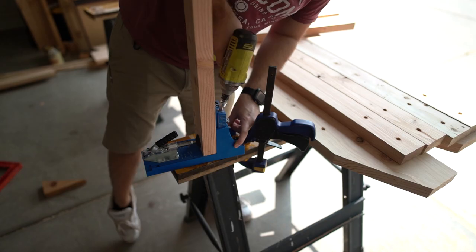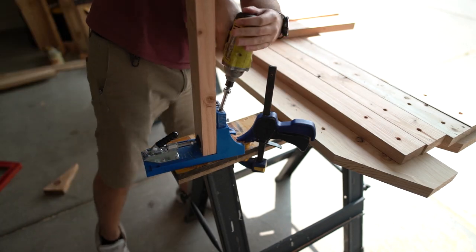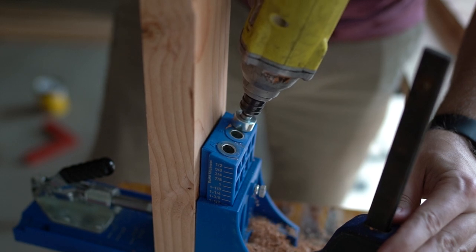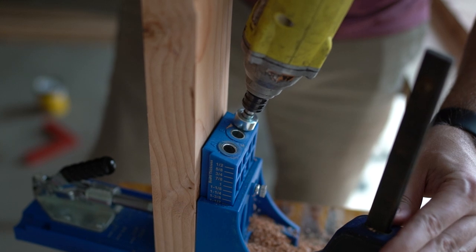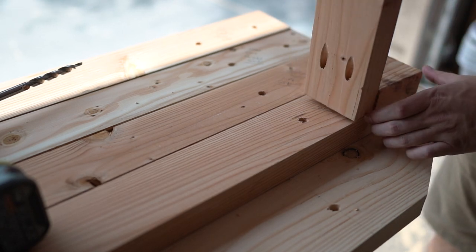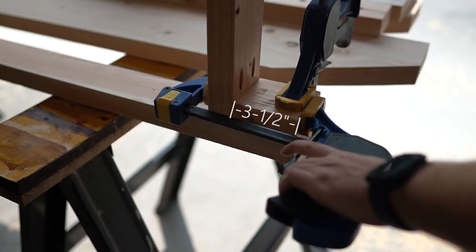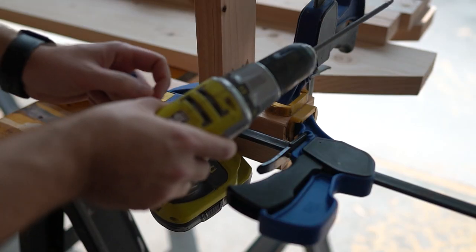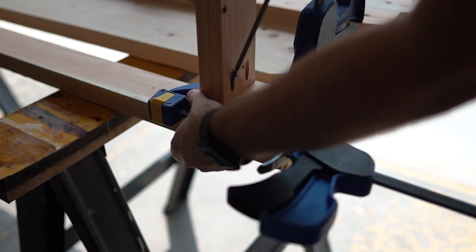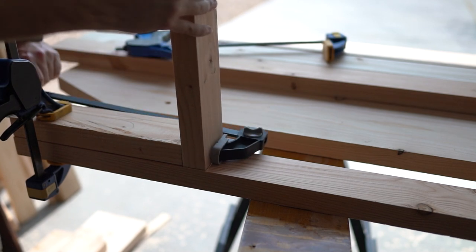I used those 3/8-inch carriage bolt holes drilled with spade bits, then did this to all 4 sets. I clamped the joists to the frame using my right angle bracket and used the holes as guides to finish the pilot holes for the frame. I made marks to make sure everything would match up later — front face, right side, and so on. Then I did some pocket holes. These are going to be the horizontal supports for the frame. I cut out little templates to keep everything easily repeatable — for these top horizontal rungs it's 3.5-inch inset — then fastened everything down with clamps. I set my drill clutch to about 11 so I'm not overdoing it with these 2.5-inch outdoor pocket hole screws. Make sure they're outdoor — they're coated to be water resistant.